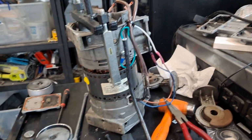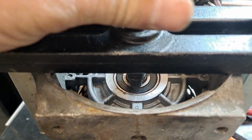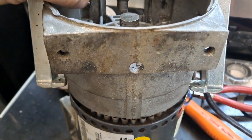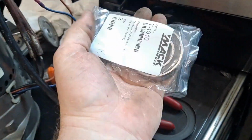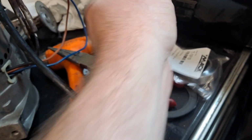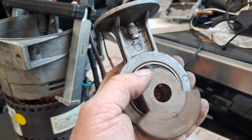What I couldn't find any information on at all is exactly what I'm doing right now, which is these motor main shaft bearings. So I'm going to just pull this out of the way a little bit. That bearing right there on mine is locked up. Actually, that one's good. I just did the bottom one, and that one was locked up solid. So I found this company, and they sell a couple sets of bearings. These are for the eccentrics, which is basically like a connecting rod. This bearing right here takes a lot of beating because the piston's going up and down, and there's quite a bit of force on that equivalent of a rod bearing, the eccentric bearing.